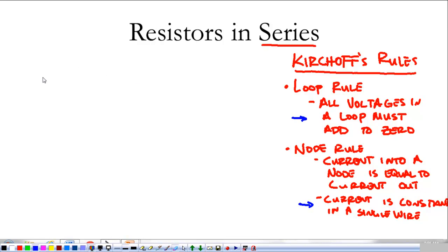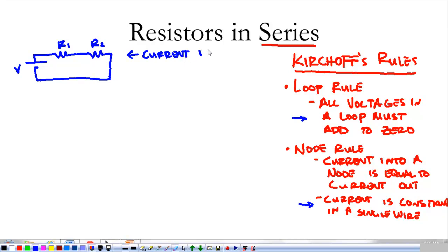So let's look at a simple series circuit — we're not going to use any numbers right now, we'll save examples for class time. We have a voltage at this battery, and we're going to go through resistor one and resistor two. This is a single wire; it doesn't split off at any point. So in series, the current is constant. The current at every point — through each resistor and through the battery — all has the same value.